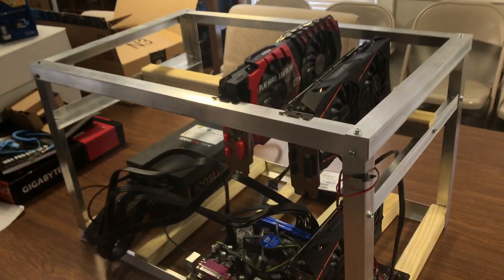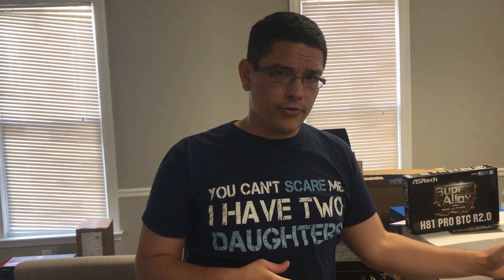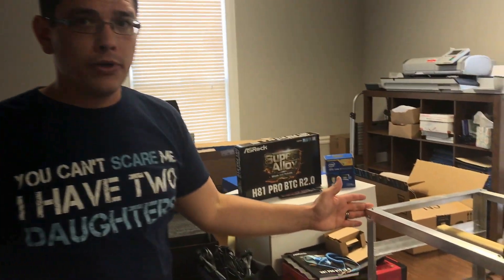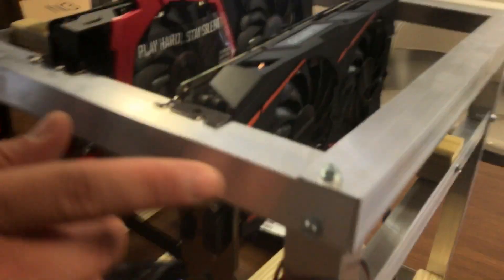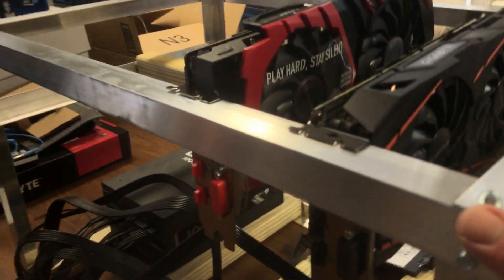The materials are really easy to find — I just went to Home Depot. Ace Hardware didn't have the L-shaped metal brackets, but these come in six-foot pieces. I used a hacksaw with 32 teeth per inch to cut them. At first I was working with 18 teeth per inch and it was really difficult; the higher I went up in teeth per inch, the easier it became. Each piece cuts in about 30 seconds.